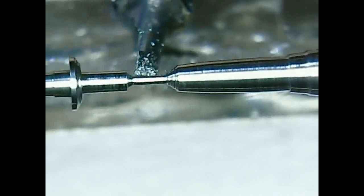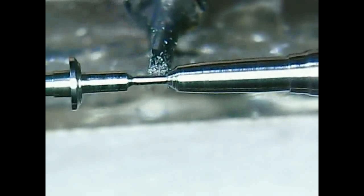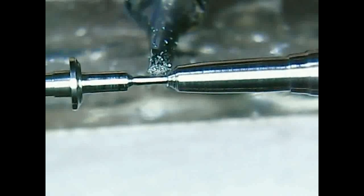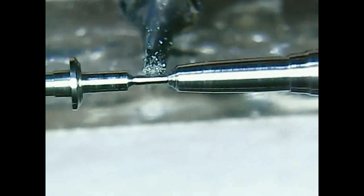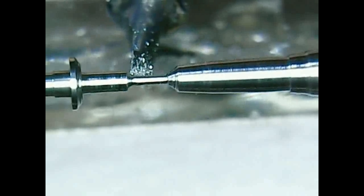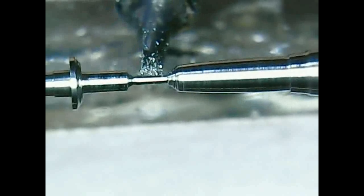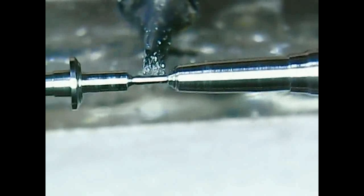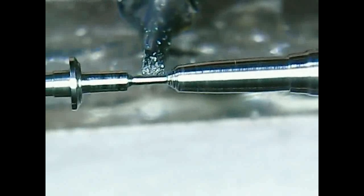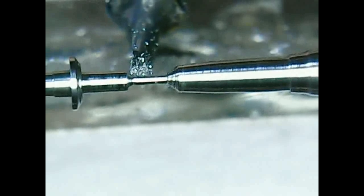So from here on, one needs to be really careful. So here we have a really thin material, and we need to get back to the other parts of the balance staff, making some adjustments. It will break here. So when everything on the balance staff, the previous parts, is okay, then we can move to this lower pivot.